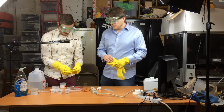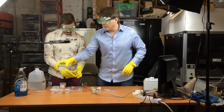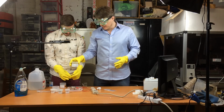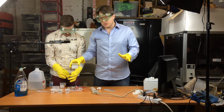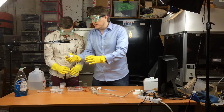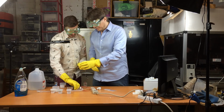So we're gonna rinse this out in the sink. We're also gonna dump out this solution. I'm gonna put the gloves back on because we're still handling some of these solutions here. We have this solution, which was the discard water. If you were running a metal plating shop or you were an industrial producer, you couldn't dump this out in the sink. But in this case, I think it's probably okay. Although if you're concerned about it, this technically should be hazardous wastewater. But we have such little amounts of chemicals, and you're not dumping out these chemicals. You've saved them, okay? For potentially down the line if you want to do this again or on someone else's watch. We're just discarding the rinsing water.